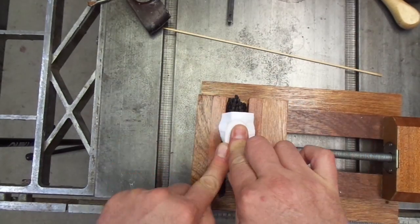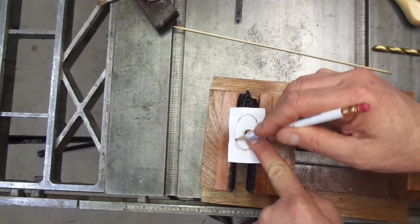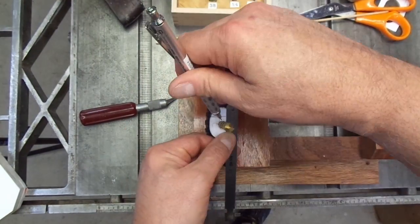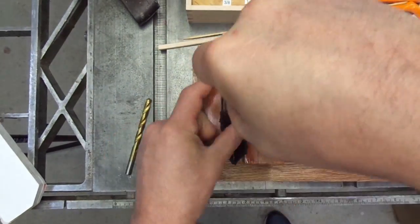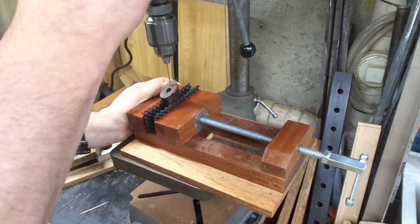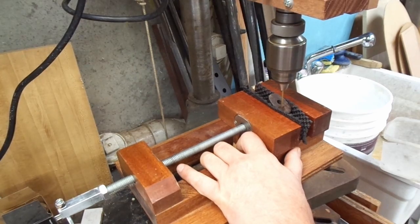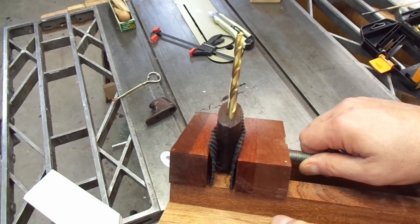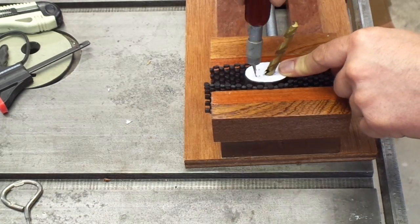Here I'm making the drill guide. Now I'm marking the holes where I think they look good. I'm using the drill press to locate the tote piece in the vise, aligning the bolt shaft with the quill of the drill press. This should guarantee that the holes I drill will be parallel to the bolt shaft. And I think that's looking pretty good in both the X and Y directions. Kind of hard to get it on camera. The other half was the same.